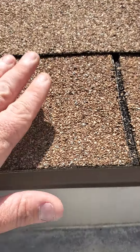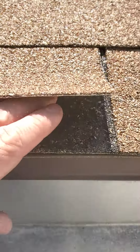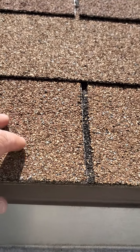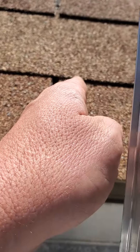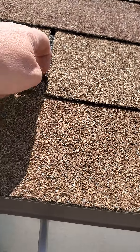There's a row of shingles underneath your main shingle that goes all the way around the perimeter of the house — they call them starter shingles. I'll show you what those are right here. So here's your shingle, and this piece right here is your starter shingle. These starter shingles are supposed to be staggered from these, so if this shingle starts right here then your starter shingle would start in the middle.